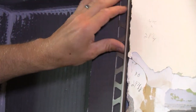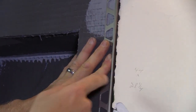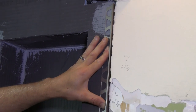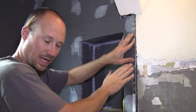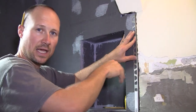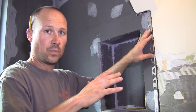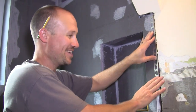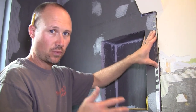With three-eighths edging, you can see it does stick out a little bit, so that is a bit nicer. If you jump to a half inch, the downside is the tile will be almost buried inside it and it won't look as good. So I think three-eighths on this side and five-sixteenths on that side. This doesn't happen very often — usually both walls are the same — but this is one case where we have an interesting difference, so keep that in mind when you decide on your sizing.